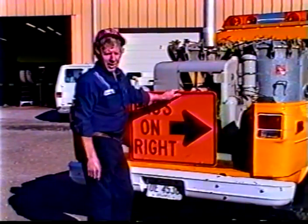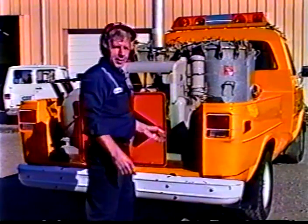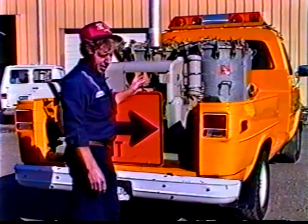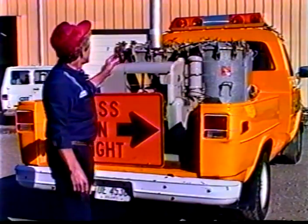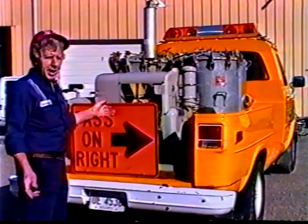The power assembly here is a four-cylinder Wisconsin and a Quincy air compressor that was taken off the same Unimasco. It powered the whole equipment. Right now, all it does is power the air compressor to run the painting system. We have three 60-gallon tanks on there now, so that a 55-gallon drum of paint will fit in the tank without any problem.